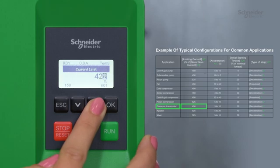We set type of stop to deceleration. Soft stopping by control of the torque is well adapted for this kind of application. By default, torque control is active. Refer to the user manual for more information on torque and voltage control. We can now set deceleration to set the time to decelerate from the estimated torque to standstill. Then, set end of deceleration to set the final torque level between 0 and 100% of the estimated torque at the end of deceleration. As soon as the estimated torque is below the value set in end of deceleration, the motor switches to freewheel mode.